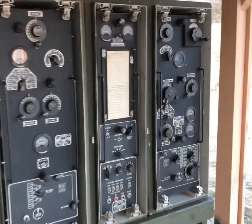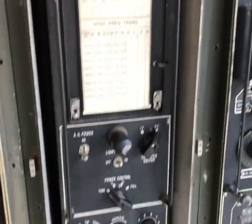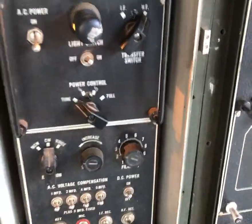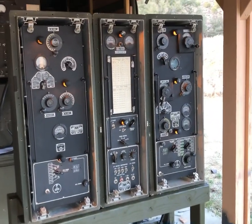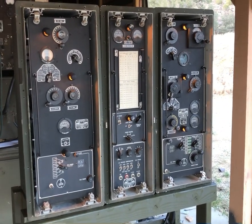We're just checking out the basic systems after going through and making sure everything looks okay internally and tubes are in place. We'll fire up the DC power — on this transmitter, that DC voltage is used only to illuminate the front panel lights, which I love by the way, and also to power the keying relay.